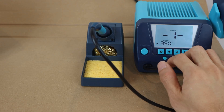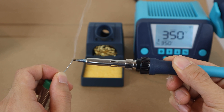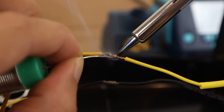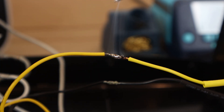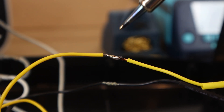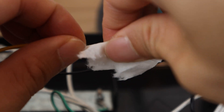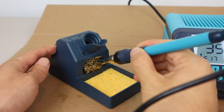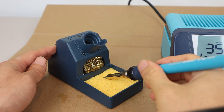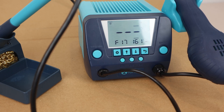Let's try soldering some stuff. I'm going to set my soldering iron to 350 degrees Celsius and let it come up to temperature. You'll want to pre-tin your soldering tip and work in a well-ventilated room, or with a fan to draw away any fumes. I'll carefully feed soldering tin onto the two wires I want to join. You can see that the soldering tip transfers heat to the wires quickly, allowing the tin to flow freely, so I don't need to keep the iron in contact with my components for a long time and risk damaging them. After use, wipe off any excess flux, then slide heat shrink wrap over the connection. Remember to clean your tip by lightly pushing it into the cleaning wool and wiping it on a wet sponge. I'm going to turn the soldering iron off now by long pressing the soldering button, since I'm switching over to the rework tool.